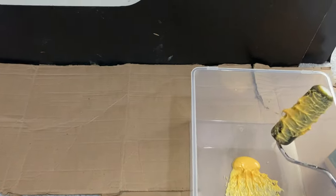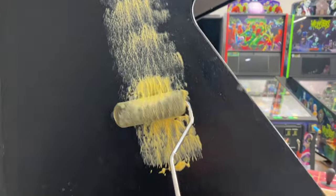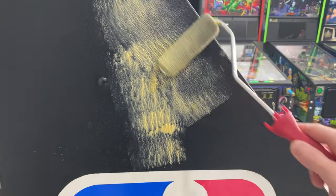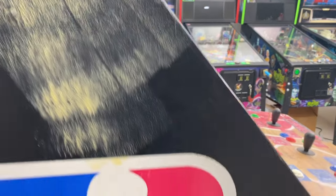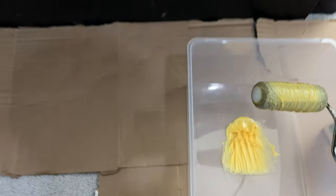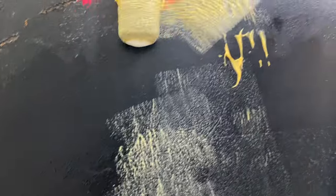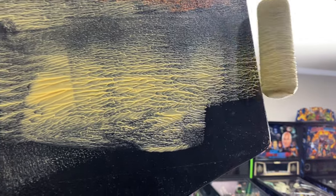Put something down to protect your floor, and don't go fast with this because it will fling and fly everywhere. You want to give it a generous coating — be nice and generous. Get as much on there as you can; err on the side of going thicker. You really want a nice good dollop on there. Don't worry about going back over the art. You're going to apply the Citrus Strip, then wait about 30 to 45 minutes, then come back and scrape.